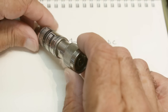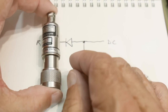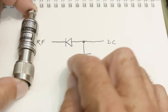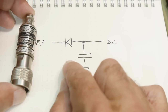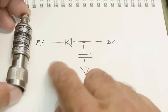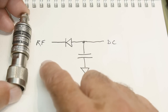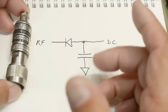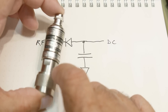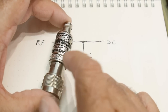This thing is fairly linear. Usually these are specified with some type of linearity over one decade — or an octave — so many dB per octave is the way these things are specified. I think this one is plus or minus 0.2 dB per octave, so it's fairly flat.